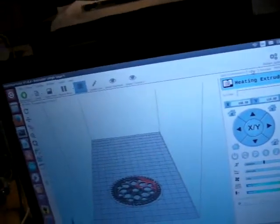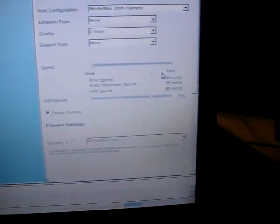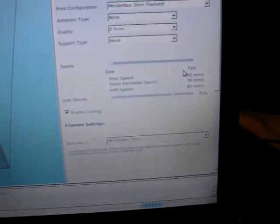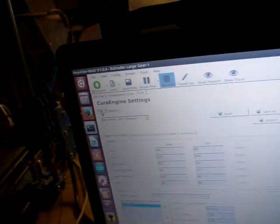Let's look at some of the other settings. The print speed I have is just slow: print speed is 40 millimeters per second, outer perimeter speed is 30 millimeters per second, and infill speed is at 60 millimeters per second. When you set up the Cura engine — the one I default installed on Ubuntu — you've got to set up a couple different things: first the speeds, the print travel, and so on. Also your quality, which is your default layer settings.